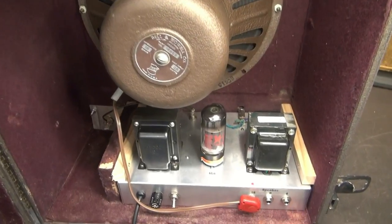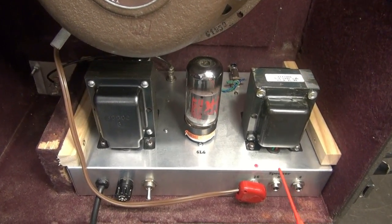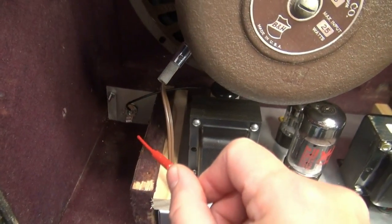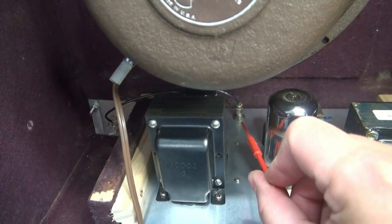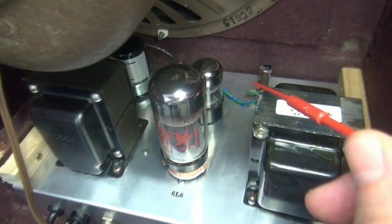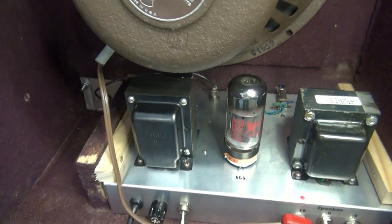Here's the final product. Chassis installed — I added some three-quarter inch blocks here to secure it, so it just slides in like a drawer. There's the output for the speaker, which goes up to the original connector. The input — since it was way over here, I had to use a piece of coax, and it goes to an RCA jack; it's the same type that Fender uses on their tremolo and reverb pedals. There's our 6L6, the 6SL7, and the idiot light. There's our transformer with our various speaker taps.